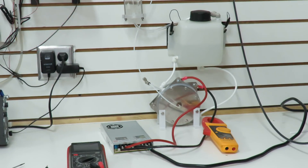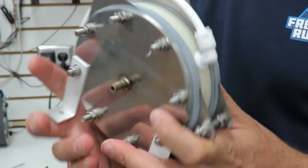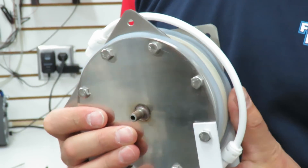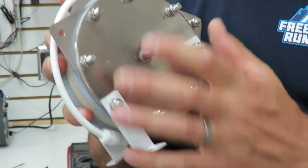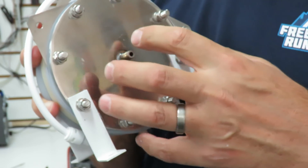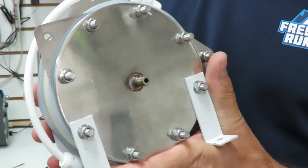I've been working on a new cell and this is what I've come up with. This is a PEM cell. This uses no KOH, no electrolyte in the water. The electrolyte used in this is on the membrane — it's SPE, solid polymer electrolyte, which means it has a solid electrolyte actually on the membrane. And it makes the reaction happen right on the membrane with pure distilled water.